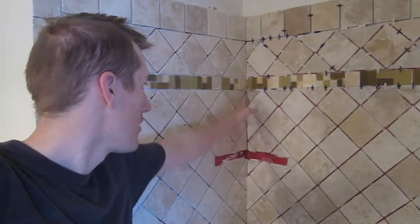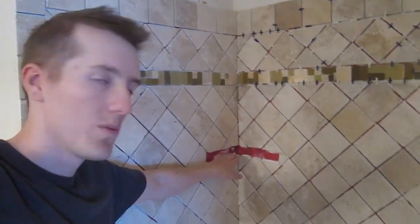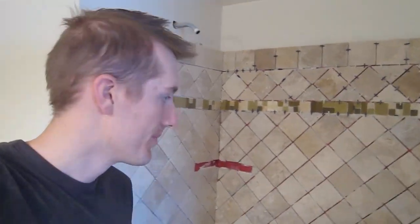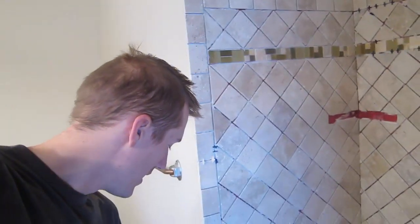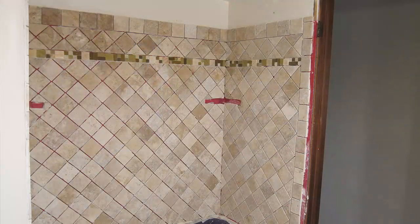We'll also do the colored grout caulk in the corners, and when that dries, we'll put in the shelves, and then we'll caulk along that. And then we're gonna use white silicone caulk along the outer edge and where it comes in contact with the tub, and we have that colored caulk grout for everything else in the corners. So we have to wait 3 days. We'll do the grout, then we'll seal it, put the shelves in, and hopefully it will be done, and we get to do it all over again for our other shower.